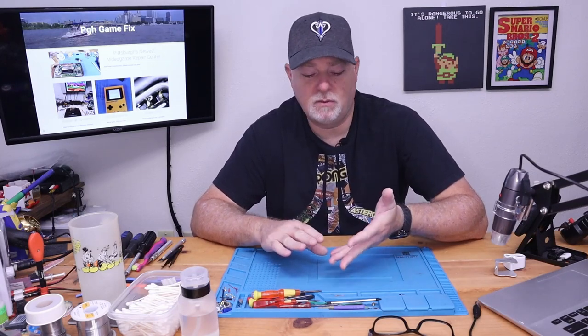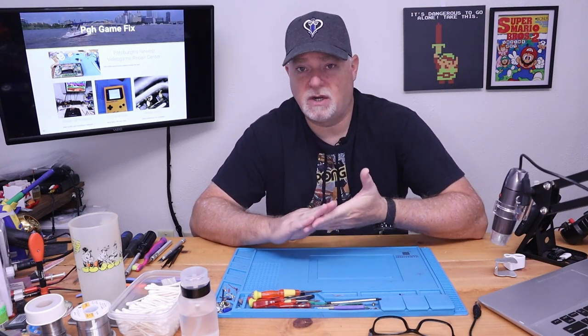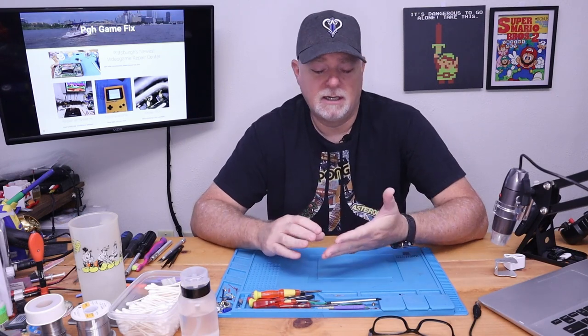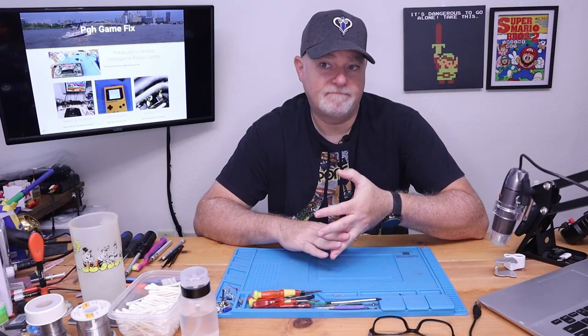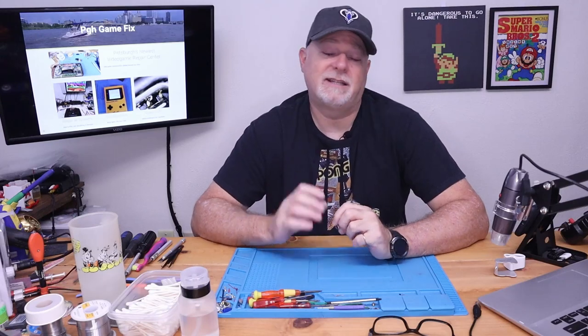The standard board that you'll see most of is what's known as the VA-1 board. There are two kind of versions of it - a 1 ASIC and a 2 ASIC chip board - but for the most part that's your standard board. Those are easy to fix, the parts are plentiful, and replacement parts such as power supplies and audio boards are actually starting to become available through places like Handheld Legend. The screens from McWill and Retro 6 and even from our friend down in Australia - all the screens being built right now work with that type of board.